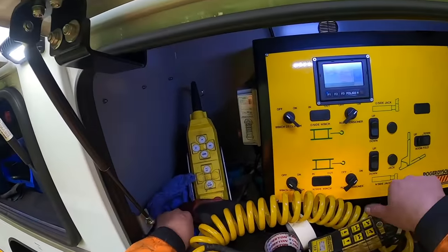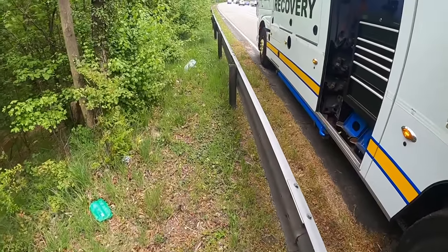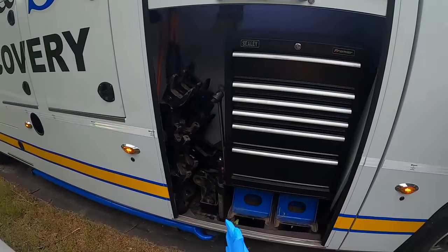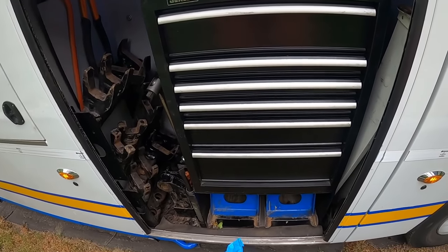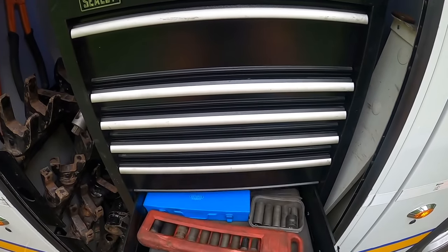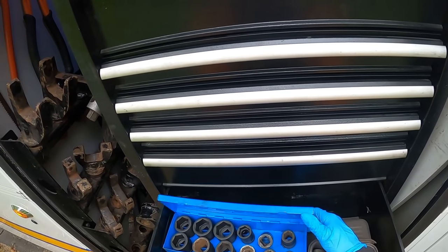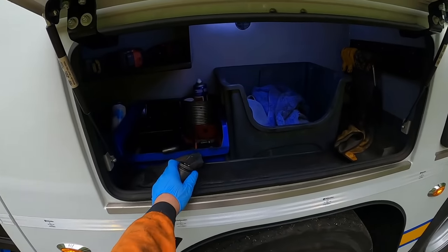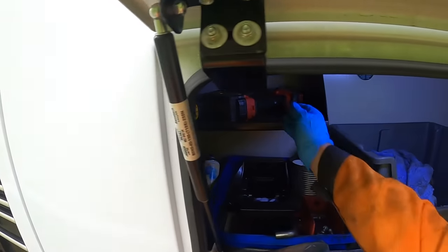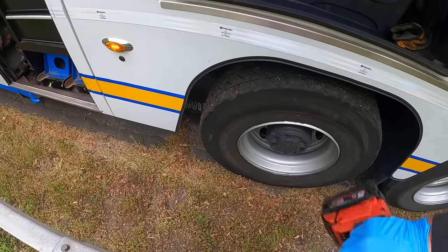Do that next before we do the airlines. So we pull the half shaft to disconnect the drive, so there's no internal movement in the gearbox while we're towing it. Certainly have to do it on all commercials. Sometimes it's the nearside, sometimes it's the offside we take out. But on these Mercedes, it's the offside, unfortunately, we have to pull. The diff locks are on the nearside.